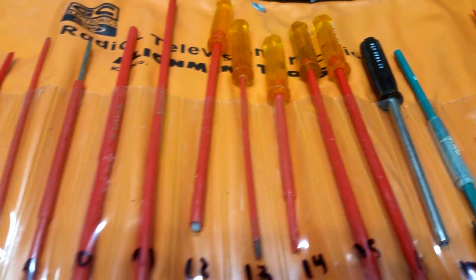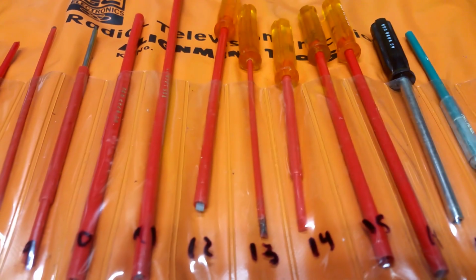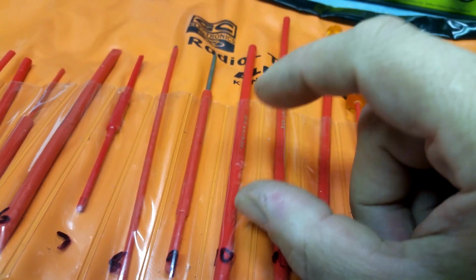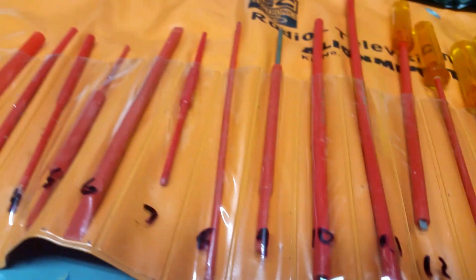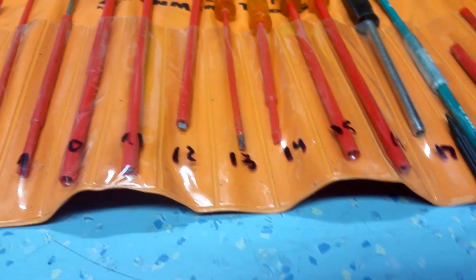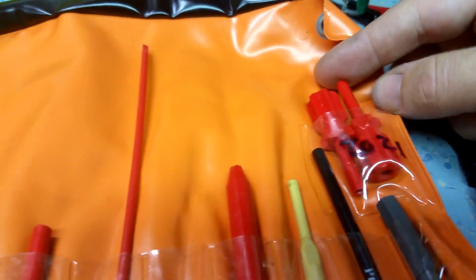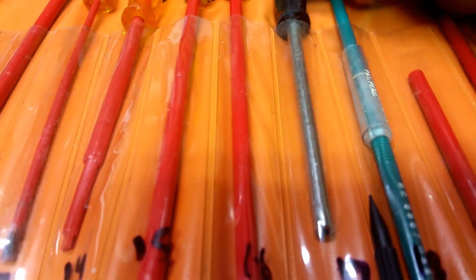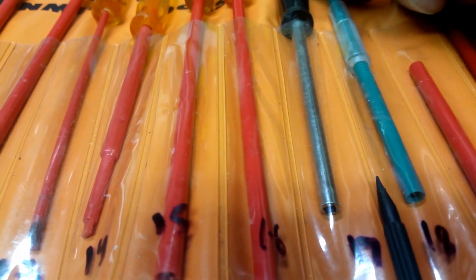So they've got those types, and they have a small 4.5 mil nut on the top, but they've got a little pigtail at the top as the thread comes out. So you need something with quite a deep socket. I think I've got tools for adjusting those. And we've got various short stumpy ones which are useful. The trouble is this gear is quite expensive. We've got a metal one here, obviously, for adjusting cores that aren't sensitive to induction and are a bit stiff.